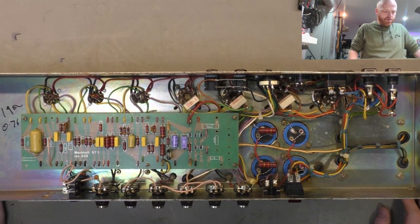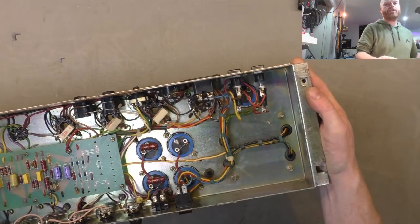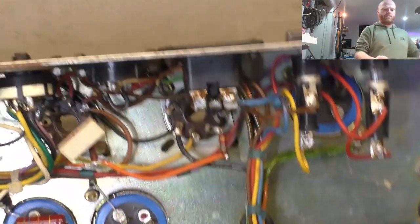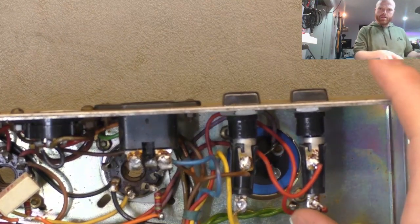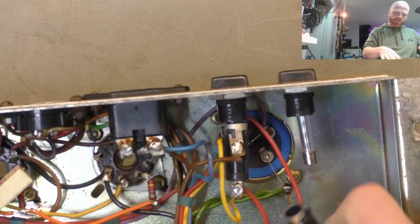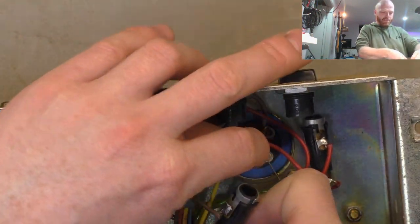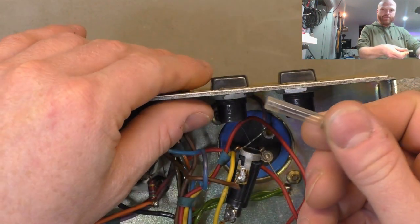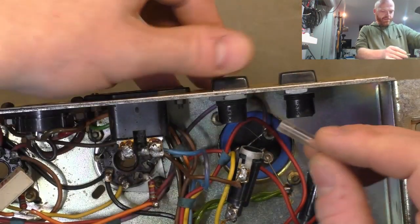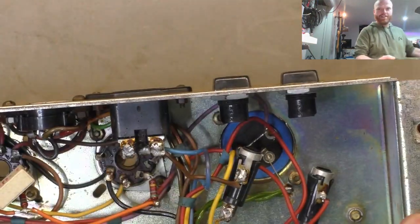Overall, no real horror show. Just having a quick glance, starting to see some bulging in the middle of the caps there as expected. Moving to the power side - that there is a broken fuse holder, and the other one's broken too. Isn't that lovely. So two new fuse holders needed. The fuse appears intact but the tip has come off that one, just pulled the wire out, so we can't really tell if it was blown. But yeah, two new fuse holders.